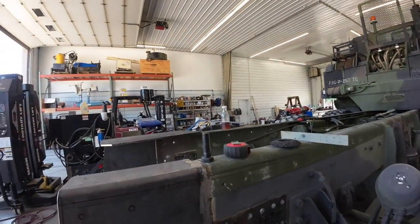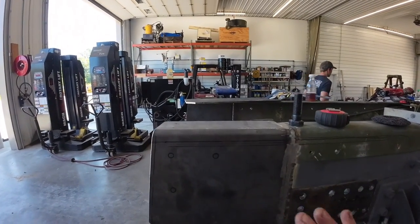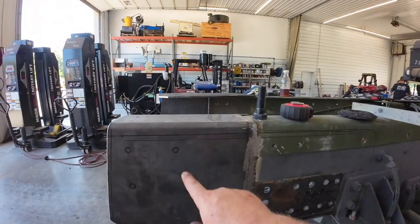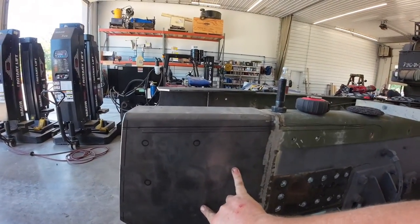We got our mag drill sitting over there. I think we're going to drill a little hole through here first so we got a reference. And then we'll bolt this plate up here, then we'll poke back through with that hole. And we're going to drill those out to 7/8. We'll probably pop a couple more holes in here just for strength. Maybe a couple in here.